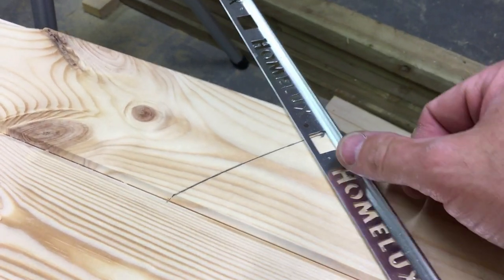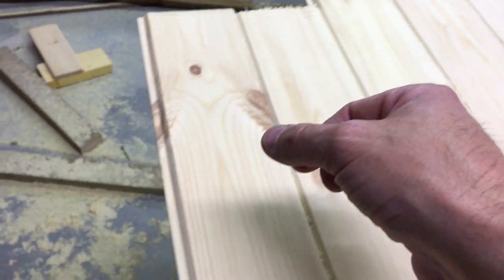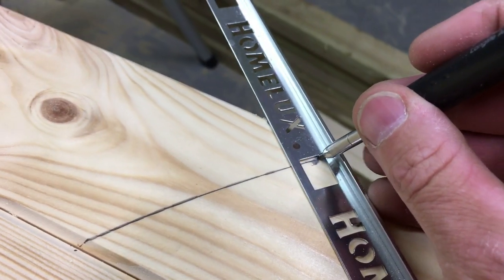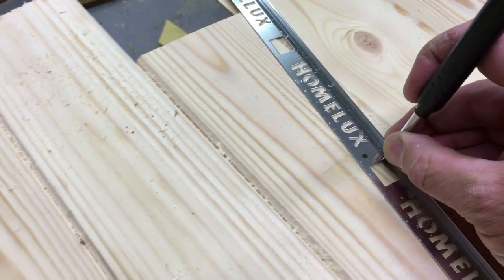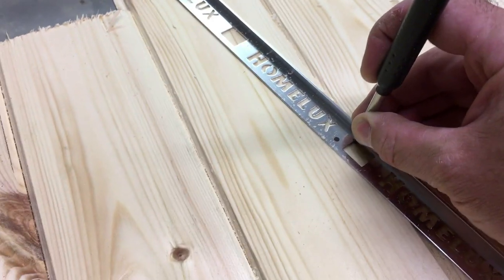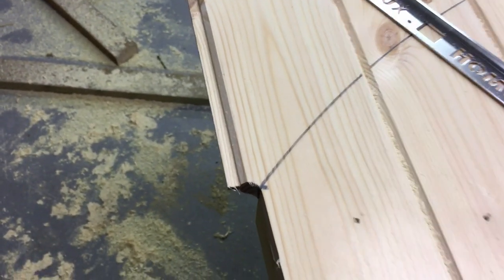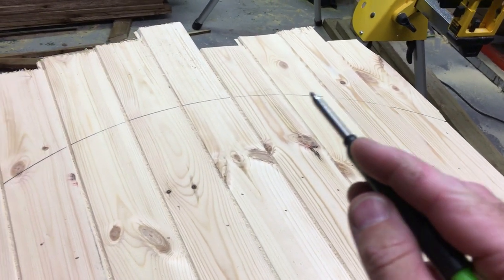This is an old bit of tile trim that I've screwed in at the centre. I've lined up the corner of this square with the edge of the gate there, and I'll just hold the pencil in that corner and then swing this round — and it should hopefully meet up with the mark on the other side. That's a perfect curve. You can see how it hits that mark perfectly. That gives a nice even curve at the top of the gate. Now I'll carefully run around this curve with the jigsaw.